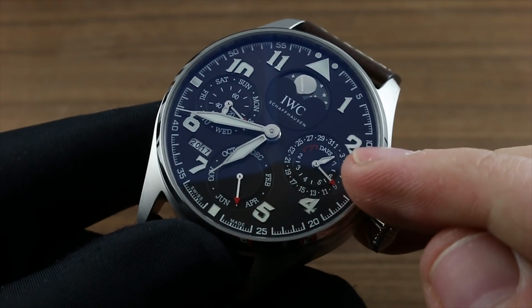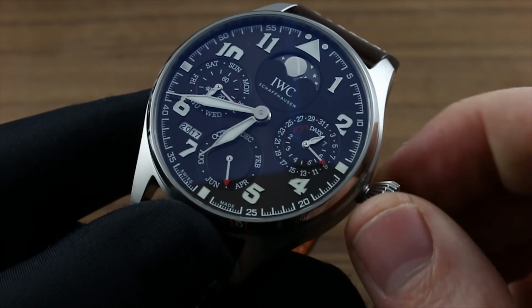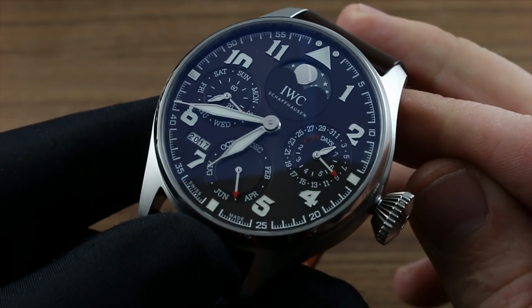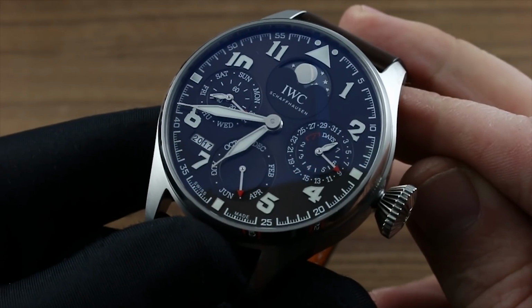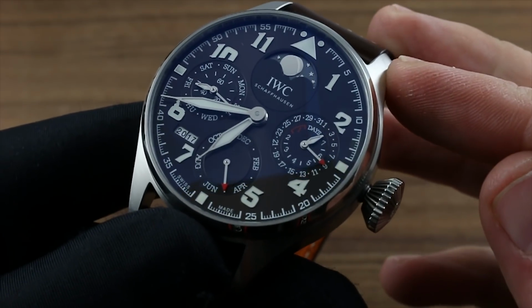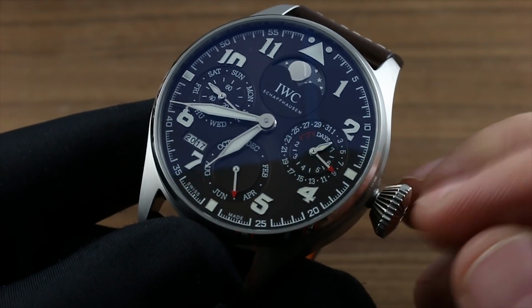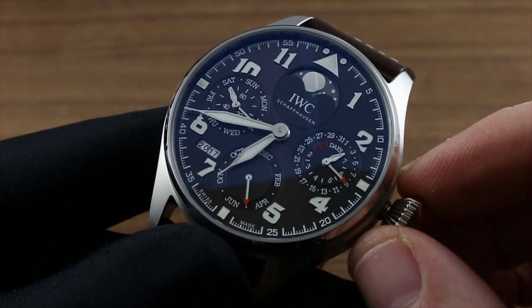You'll note that the power reserve gauge within the register at 3 o'clock reaches the 7th day, but continue turning until you hear a subtle click or tick within the watch. That's the bridle-style mainspring slipping by design. It lets you know the watch is fully wound, and it alleviates any extra stress such that you cannot accidentally overwind the watch.